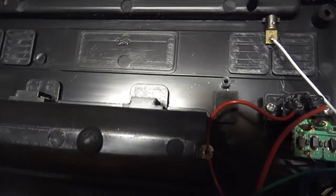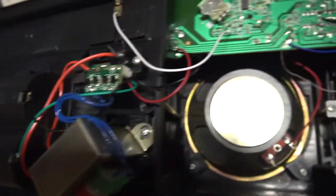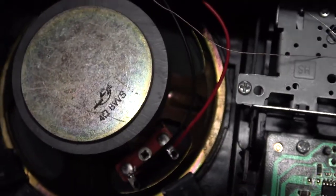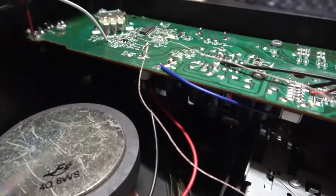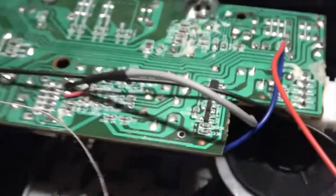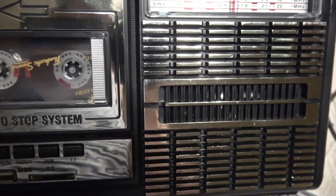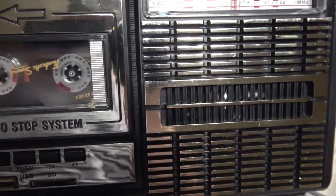I can admire the quality of the mold — I'm being sarcastic — but anyways, it does a job. And this is the MP3 module over there. The speaker: 4 ohms, 8 watts — kind of a beefy speaker and magnet. Can we have a look underneath the board? We don't see anything. I'm not willing to open up everything. These are some filter caps over there. Switches. That's the gut shot. With the cassette on pause you can hear there is this residual noise — and sadly that's part and parcel of having an entry-level machine like this. Even back in the 90s, that was already the case.